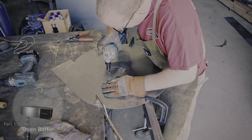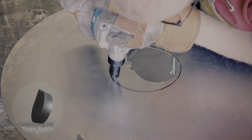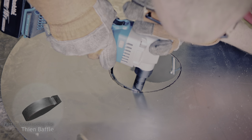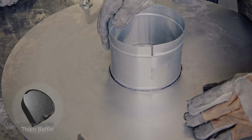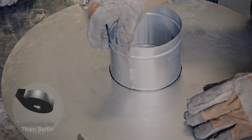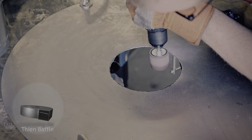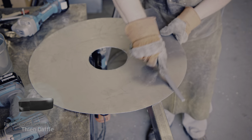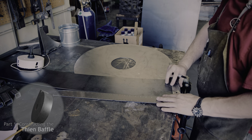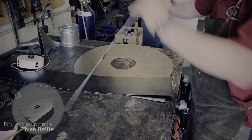This is a good point and case for how proper tools can make everything move much faster. While the nibbler works exceedingly well, getting the right turning radius took some practice. As a result, I am approaching the circle with multiple overlapping operations. And there we are, almost a perfect circle. Draw filing is pretty quick to remove the sharp and jagged edges left by the bandsaw. All this preparation is really just procrastination to avoid bending the strip of 6 inch wide sheet metal into a circle.